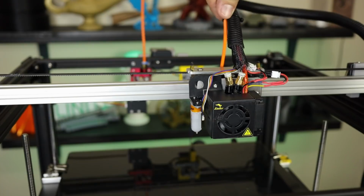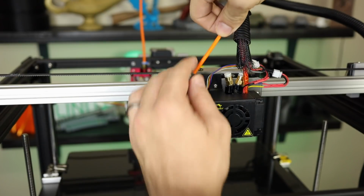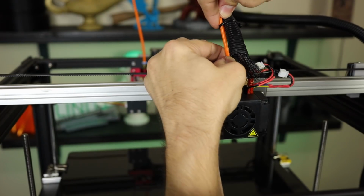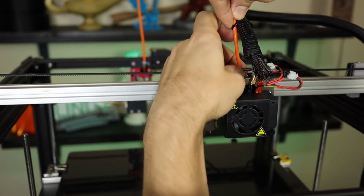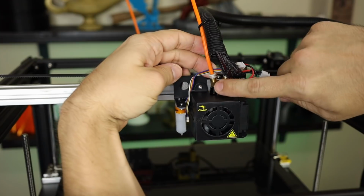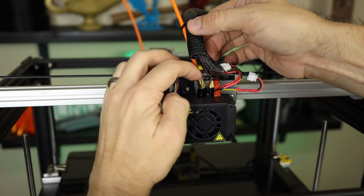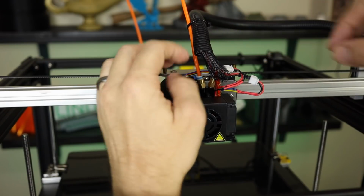So we'll take our first Bowden tube, which we already had. I'm going to simply push that over and hook it up right here. Just go as far down as we are. We know that there's a V here, so it's not going to go all the way down. So we'll take one of our coupler locks here, put that right in there, keep that from moving.